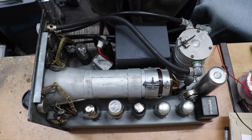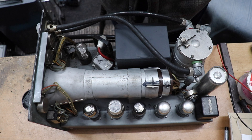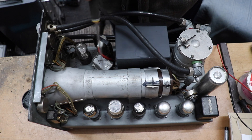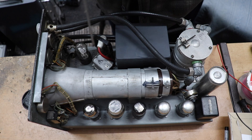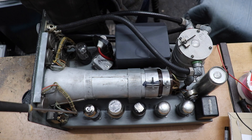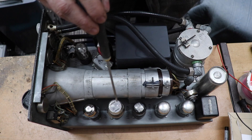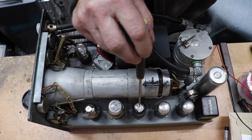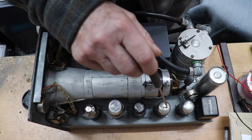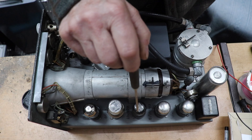I've taken the back off this display unit. The obvious thing here is the cathode ray tube — quite a nice small one. We've got a number of octal valves, typical American World War II style. Looking at the valves: there's a 6SN7 double triode, a 6G6G which is an audio output pentode but probably used in a different role here, and a 6H6G. Actually the 6H6 is a double diode. There are a few of those, though one is a different size — GT usually means glass tube as opposed to a metal valve.